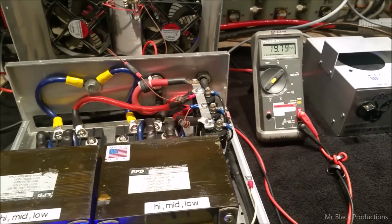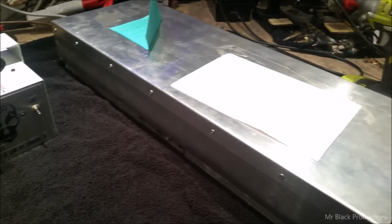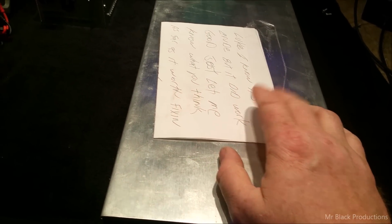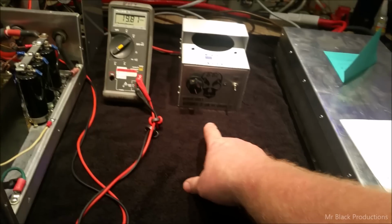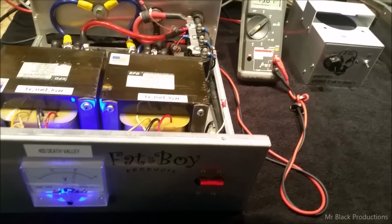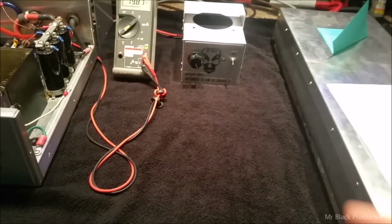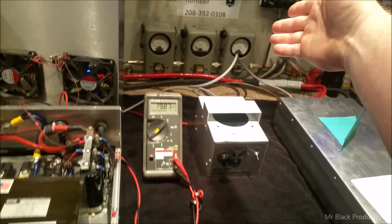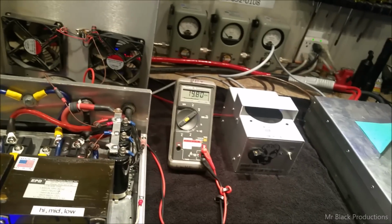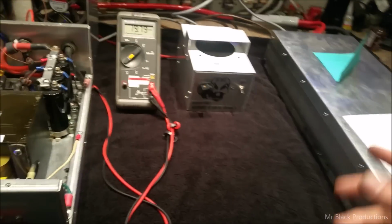We're going to run on the mid tap today because, Marcos, you're going to use a 16 pill. Now, this is an amp that I've had for over a year. It's been repaired and sitting here for over a year. It's got straight 16 transistors in it. And we're going to hit it with a two-pill SRF 3662 box, which I'm sure everybody that watches my videos has seen my video on. Two-pill hitting a 16-pill, we're going to see about 3,500 watts out of it, just roughly, about 1,200 bird coming out of the 16.